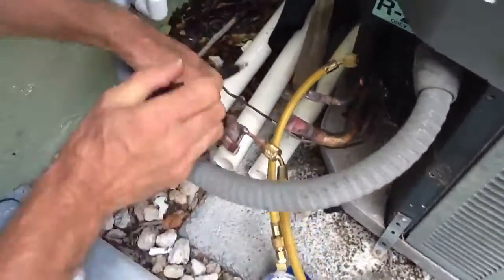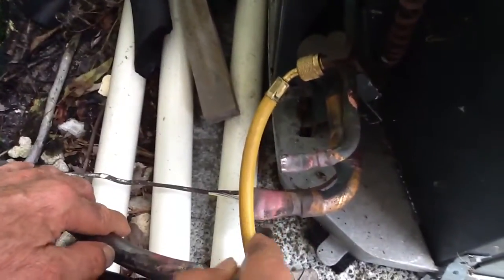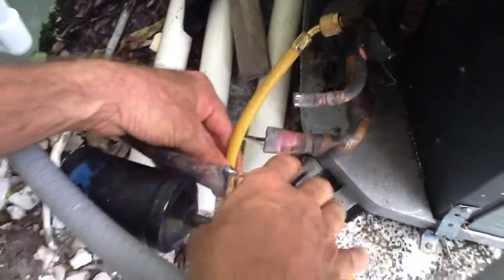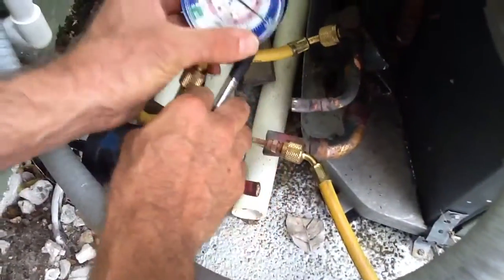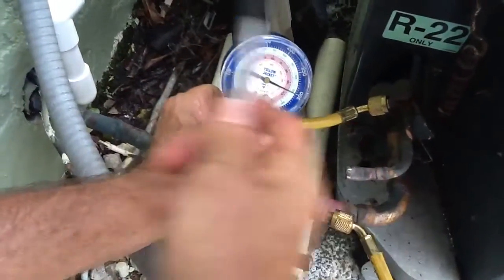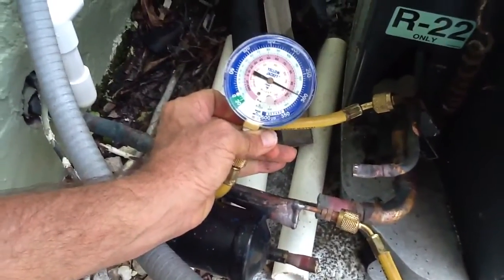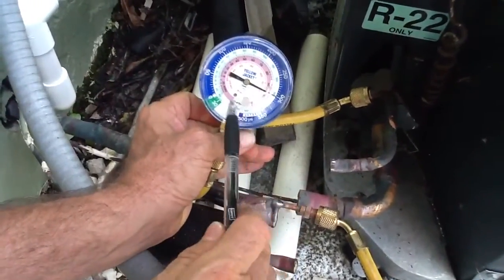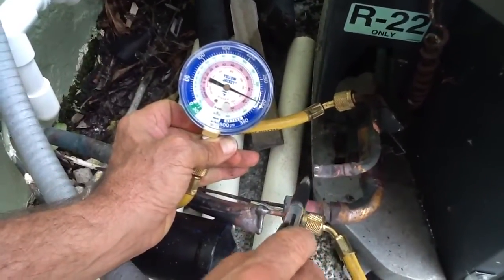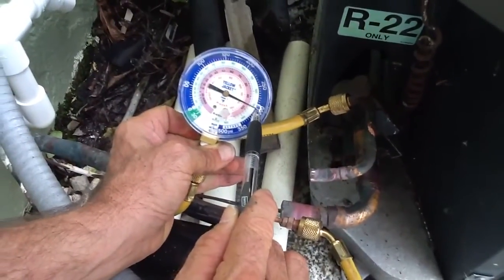I want you to look at the condenser here. He has soldered in the condenser — he's soldered in this right here and he's put another test gauge on it. You just put it in because it's going to fill up the whole condenser. 300 pounds PSI. So what he's done: soldered both ends, put the test port on it, and pushed it up to 300 pounds PSI.